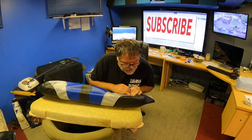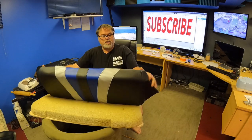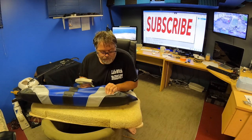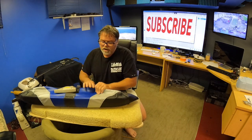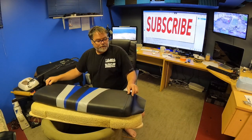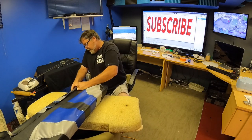This is where we're going to run into a problem — we've got to really start to stretch it in the corners. Pull as hard as you can, kind of stretch because you're going to have to get that corner down. Don't be afraid to yank on it — see it's coming good, we're getting it, it's looking good. Now that we've done that we'll go across the bottom here and give it a yank. Remember when you get to the sides you want to put lots of staples because that's where most of your pulling is at. We'll trim this back too so we don't have a big bunched-up area because that won't help when you put this back down.